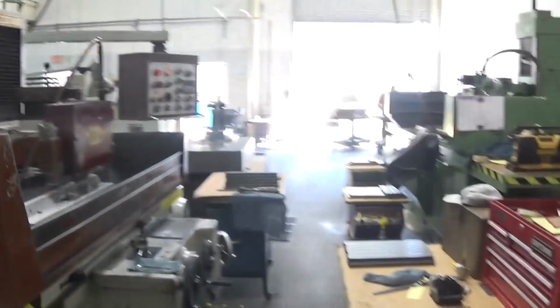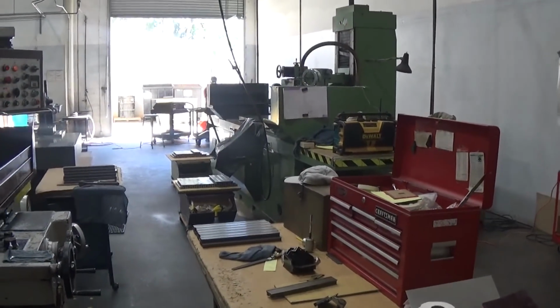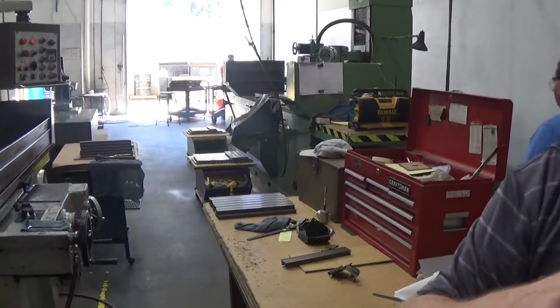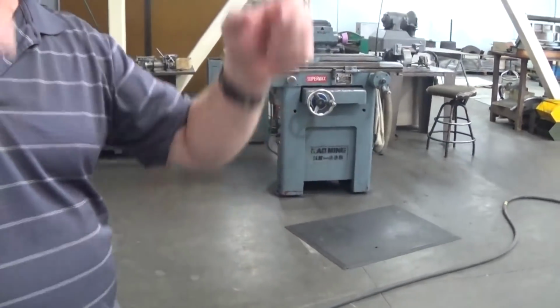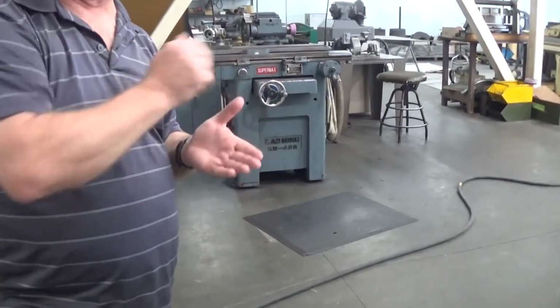That large green grinder over there does our tabletops for our rotary table. The grind doesn't have to be as perfect on that, so they can set up 30 at a time on that one. So you do these all one by one? Yes. That's impressive. And once they're measured out to spec, then they'll go off to the milling department to have the various mounting holes put in, countersunk, and the keyway is also machined in. Wow, okay.